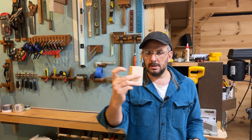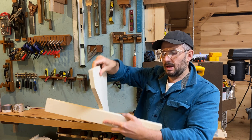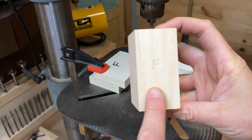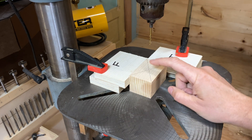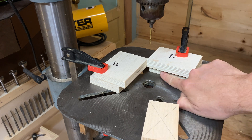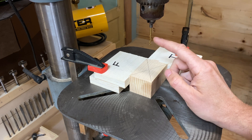In each of the eight blocks I need a hole for the rod to go through — that's the pivot point. The rod also passes through the arm on either end, allowing it to go up and down. The arms on the bottom extend out so I can have a handle at the far end. At the drill press I've got all eight blocks marked with an F for front and a T for top, with two stops marked F and T. I care that the holes are all in the same location relative to the front and top of the main housing. I start with a pilot hole first and then do the full 5/16th hole so the drill doesn't walk.